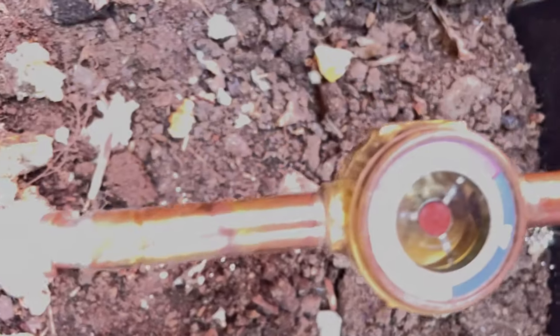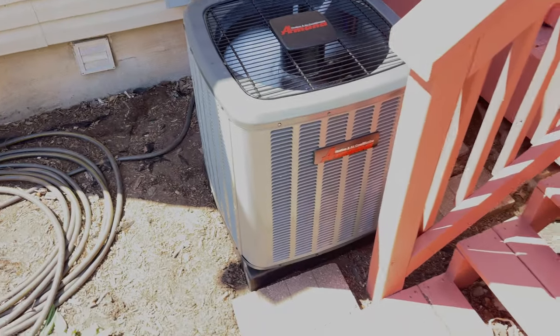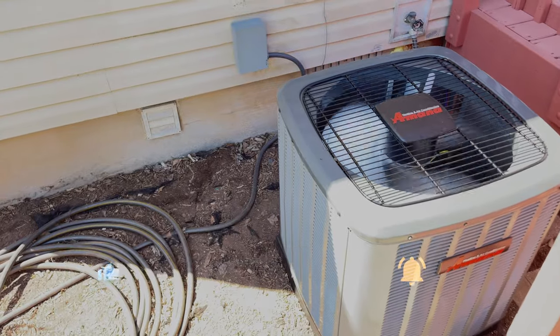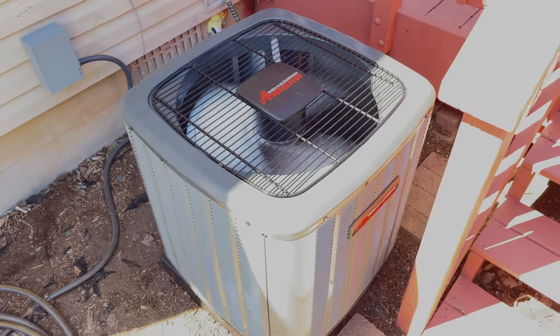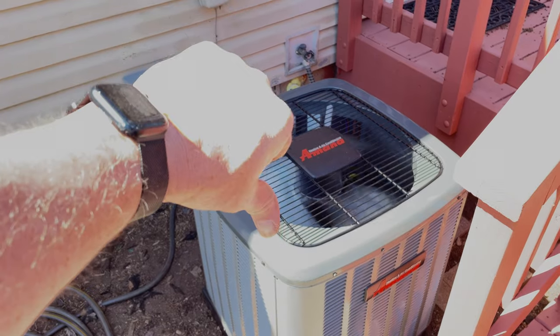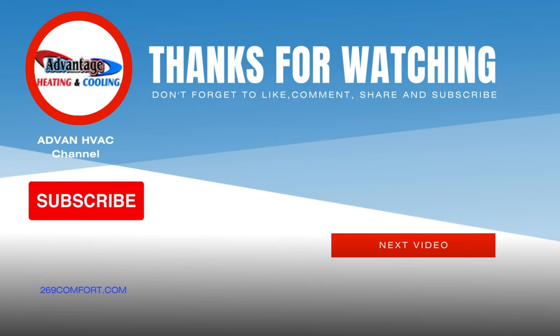We're up and going. I'm not even going to throw my gauges on this - we're about 12 feet and these are rated for 15. It's kicking out some hot air, we're good to go. This is a longer line set but I'll definitely be throwing my gauges on and checking charge. Alright guys, you know what to do - if you got any information out of this, smash that thumbs up button. If you haven't subscribed yet, consider subscribing - it'll help the channel out. Have a good one, we'll see you next time. Bye!